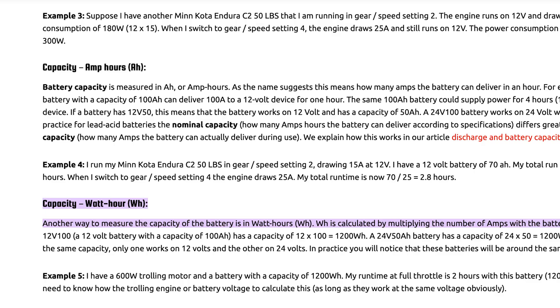Before we get into the various types of battery solutions for videography, I want to discuss battery capacity and what that means. Here at rebelcell.com, we're going to concentrate on capacity in watt hours, which is another way to measure battery capacity — calculated by multiplying the number of amps by the battery voltage. I want to share that because you will commonly see watt-hour ratings on the batteries I'll be mentioning, and it will help you understand the capacity of one battery compared to another.